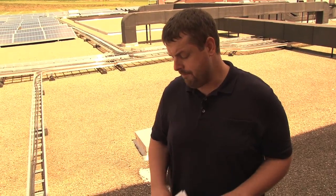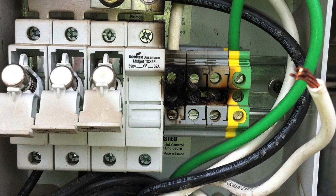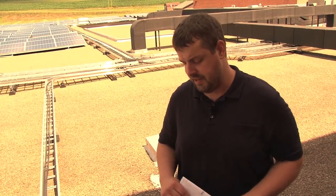Some examples of things that go wrong with these combiner boxes: one is that the conductors get chafed coming in and out of the box. Here's a picture of some chafed wires — you can see they've split, there's some arcing, and there are lots of great examples of how that's caused fires on many projects. Additionally, you want to look around the bus bars, terminals, and lugs for burning. Here's an example of one where the terminals got burned. That component is damaged and we would not be able to approve that portion of the project — that's going to have to get replaced.